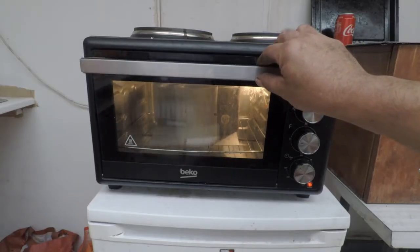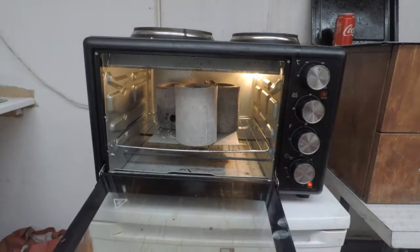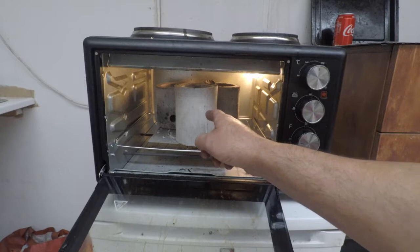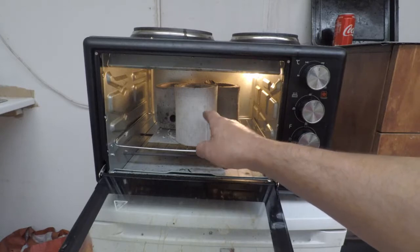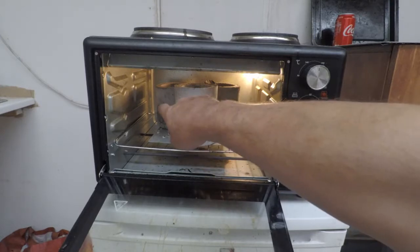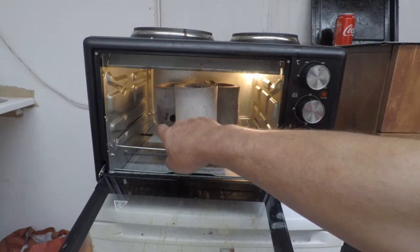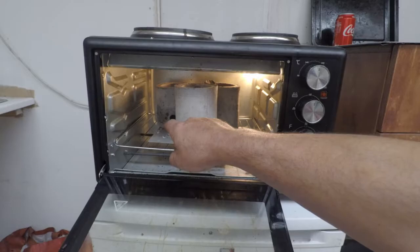And then I can tap it off like you do with the cupola and maybe even add some limestone. I'm gently drying crucibles two, three and four. Number three is my favourite. These two were very dry mix and I think that works better. That one, although it seemed like it was easier whilst I was ramming it, has come out not very good.